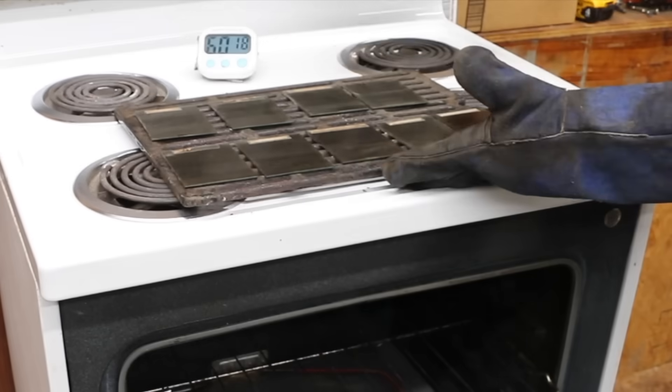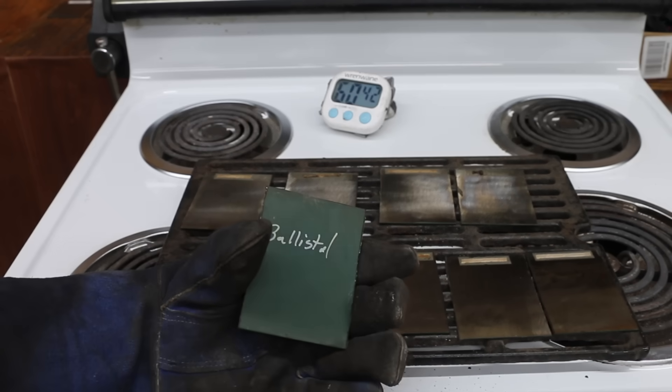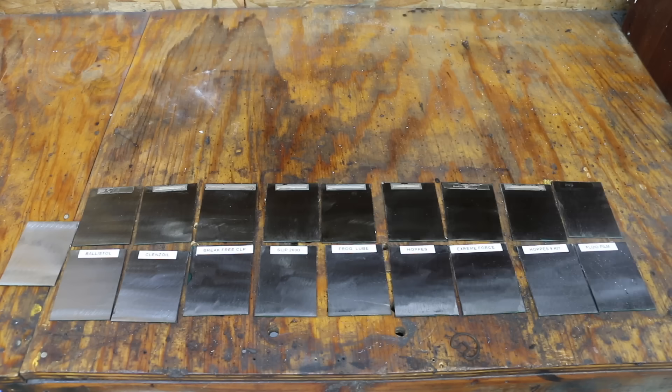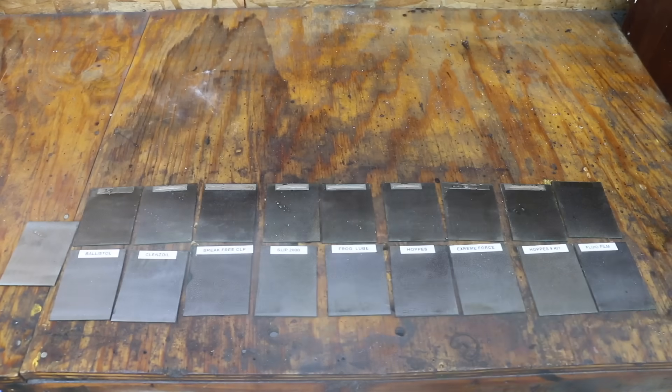It's been about one hour, so let's remove the metal from the oven and allow it to cool down before testing for corrosion resistance. The paint on the back of all the panels held up just fine in the oven. The panels without the ruined labels have not been exposed to heat. To test corrosion, I'll apply a mist of hydrogen peroxide, vinegar, and salt just one time, and we'll check back in a few hours.